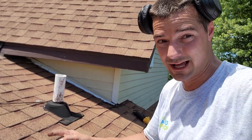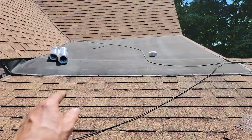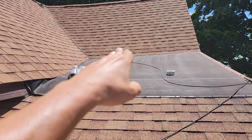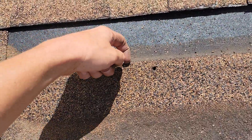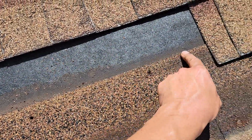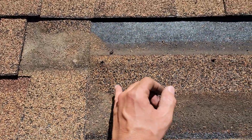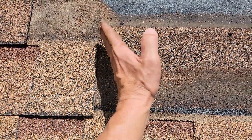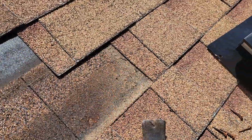This roof is steep enough, but there's definite evidence here and it's a good learning point — actually a rather bad example of keyway offset. This also ties into a similar situation with a laced valley or close-cut valley over there. Whichever side is lower, you run that side first all the way across, bring the other over, then cut the valley. When you do that, you get a little point where the cut comes down — water hitting that valley catches that point and can trickle laterally. When I'm done installing this vent, I'm going to put a small bead of sealer in a slight V-shape on any keyways I've worked to block lateral water movement.